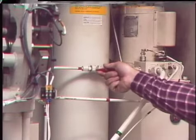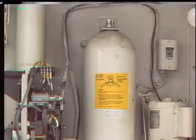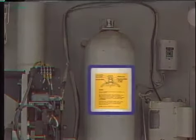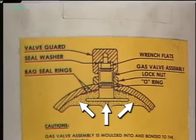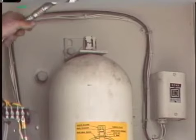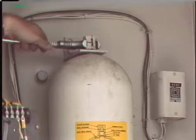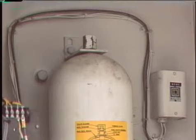When system pressure is at zero, the bleed valve is closed and a fluid level check is made. With pressure at zero, fluid should be visible in a sight glass near the top of the reservoir — if not, fluid may need to be added. For an accumulator that uses a bladder to separate gas from fluid, gas will slowly diffuse through the pores of the bladder and rise to the top of the tank. With system pressure at zero, this free gas can be discharged — a small discharge is normal, but a large discharge may indicate a damaged bladder that should be inspected and replaced.